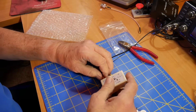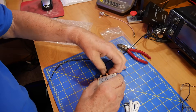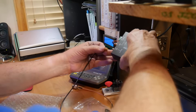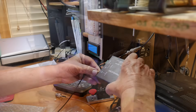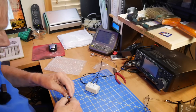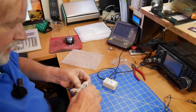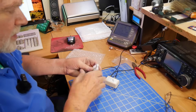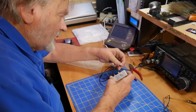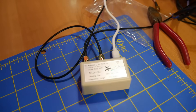We'll hook this up just like we did the last one, and this goes to the receiver. It turns out that our receiver — the SDR Play RSP DUO — has exactly the correct connectors. Now we need to power this from external power. There's no battery inside, so something to remember if you're doing this on a camping trip: you're going to need 5-volt power, such as a power pack or a big battery pack. I'll just plug this in — and it's on, with a nice little indicator light. There are no adjustments for sensitivity or anything.